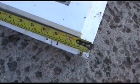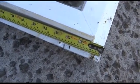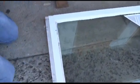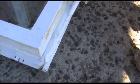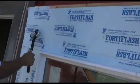Percy is marking a point three inches across from the side of the window at the bottom — this is the area where we will not apply sealant. This will be our path of least resistance. Sealant will not be applied in these two spaces at the base of the window. Now Percy is applying sealant up the side of the window — a nice plump bead of sealant toward the edge of the nail fin. This ensures we have squeeze out.